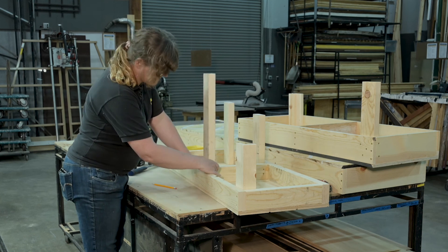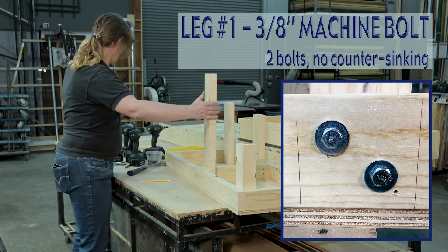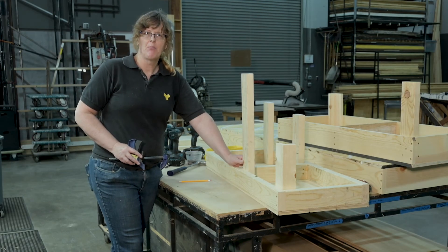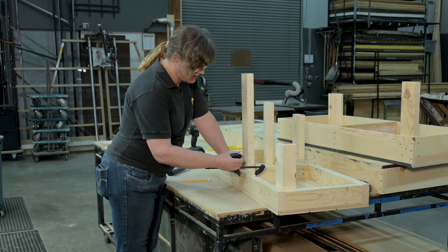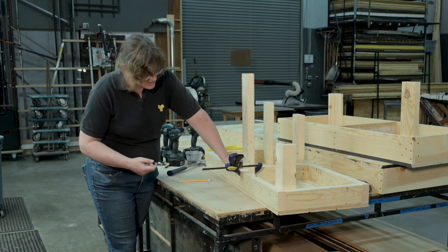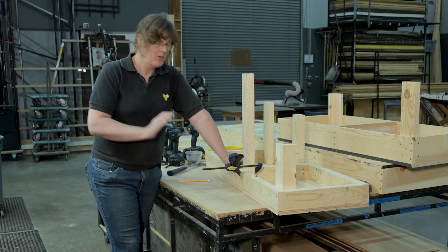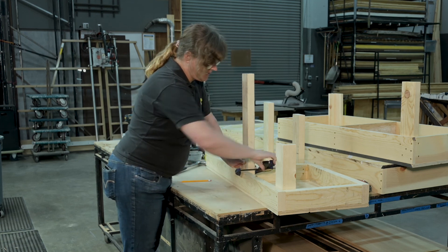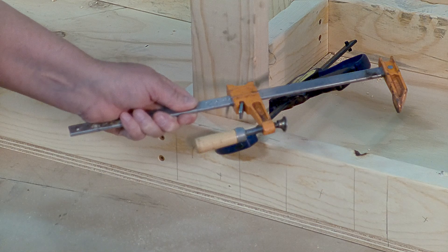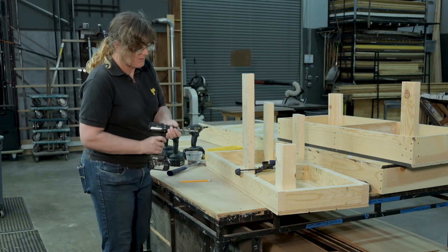Let's do the ideal one — the best one first: two machine bolts with no countersink. I'm going to clamp this in place because I need to drill through both pieces at once. Don't clamp it in a way that puts your drill in the way — if you slip, you could jam your hand or face into the clamp. Turn it around and put the clamp on the other side. I actually prefer bar clamps over Irwin Quick Grips — I feel like I can get them tighter. Got my 3/8 inch drill bit.